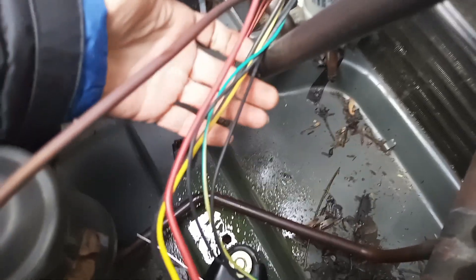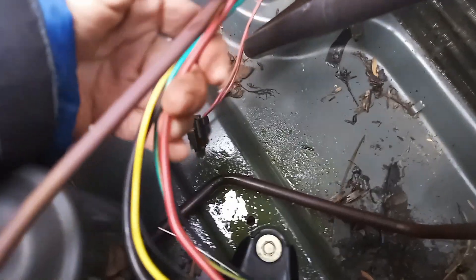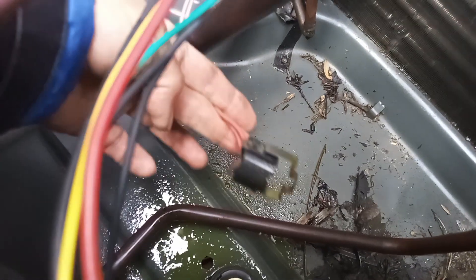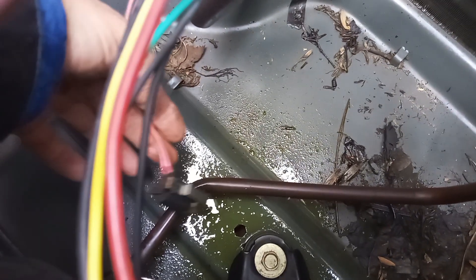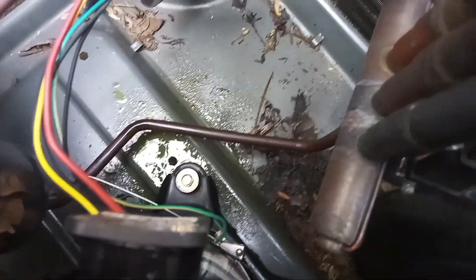Next patient. Sometimes you got to get down in there, son. We got this high temperature sensor mounted onto the line here. Vibration has caused some leaks underneath. I'm going to cut that out of there and get the Freon out of here.